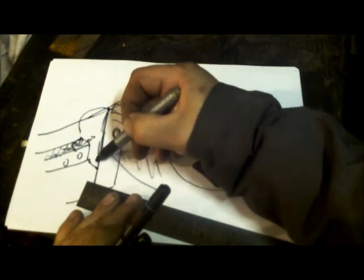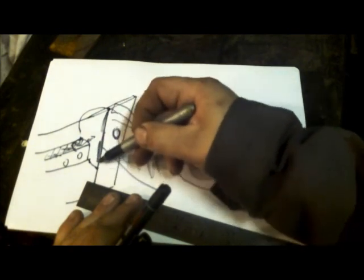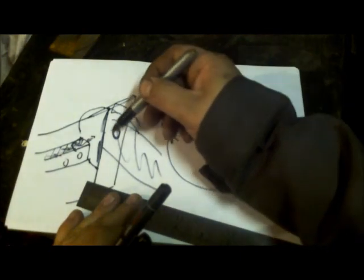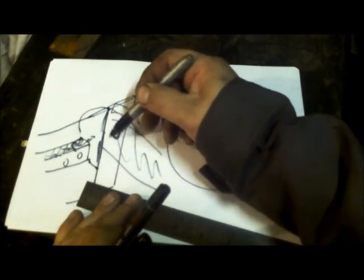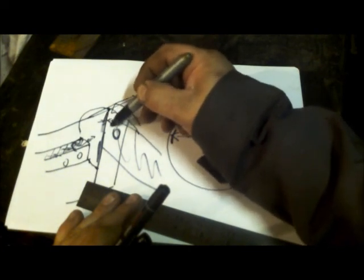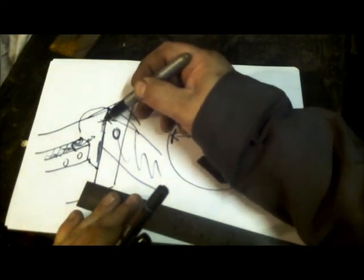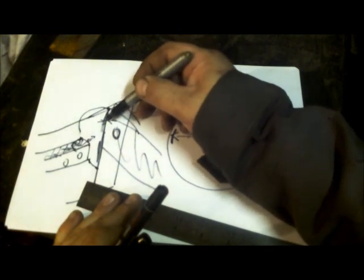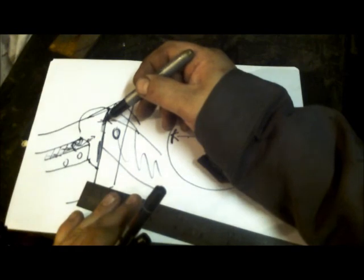All of this surface here smashing against the cut you've already made is acting as a grinder, and so it's actually slowing it all down. The contact points within the cut are also getting abraded, and there's more heat going into the steel that you don't really want to mess up anyway.